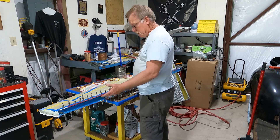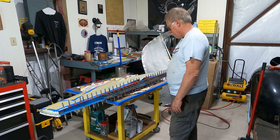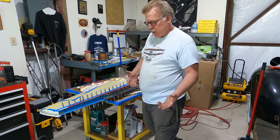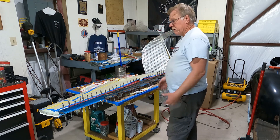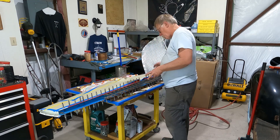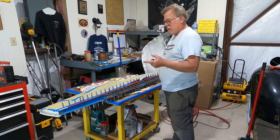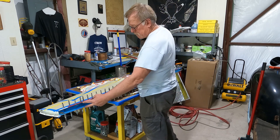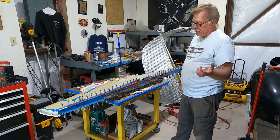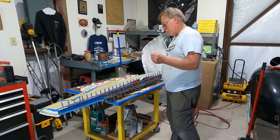It's drilled to the top and bottom skins, drilled to the upper and lower doublers, drilled to the tip caps, and drilled to the root rib. So we're now back to having a good aircraft. We have a spar replacement - again, not part of 36, but this one had cracked spars. Now I'm just going to flash forward - we're going to take this out and then I'll be making some transfer patterns off the old spars to locate the new hinges, doublers, and the nest doubler, basically getting back into Service Bulletin 36.